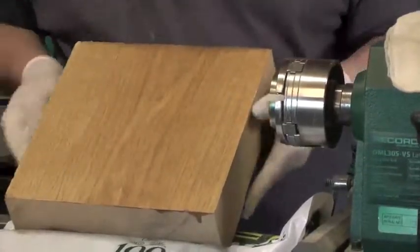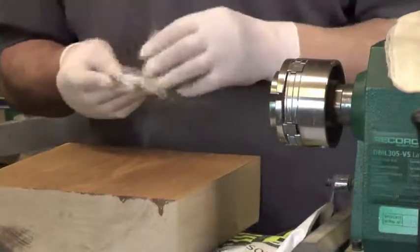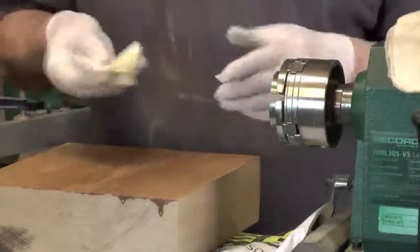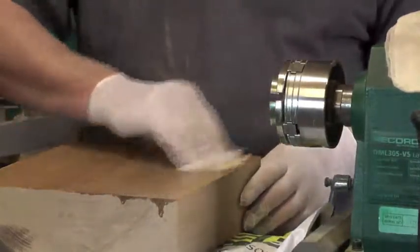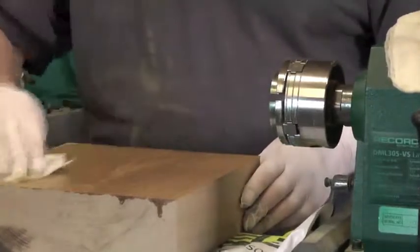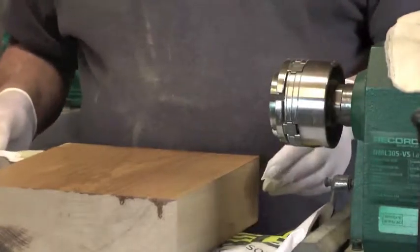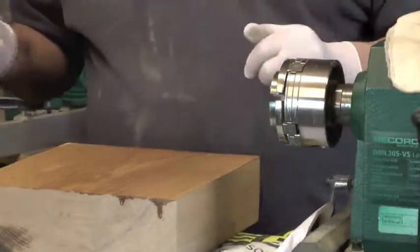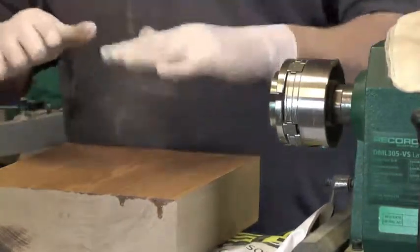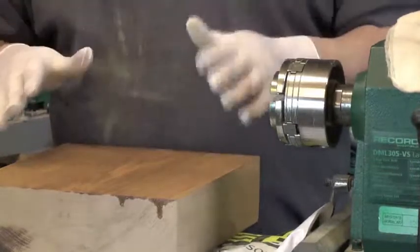This is the first coat, so we leave that after about two or three minutes, then take your oil rag and just go over it again to smooth everything out. Now this has to dry, and there's no point in rushing an oil finish. If you do, you'll trap a wet coat under another coat — it won't dry and it will thumbprint forever.